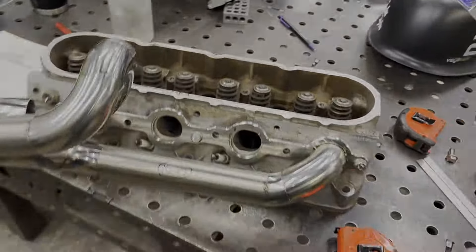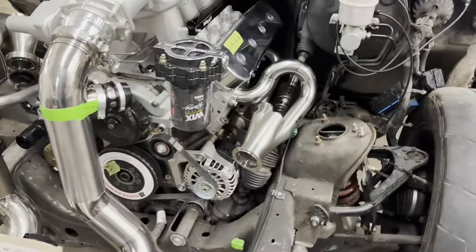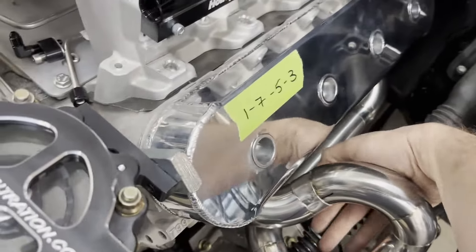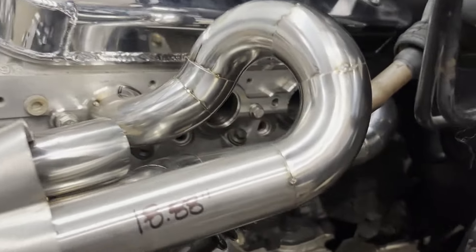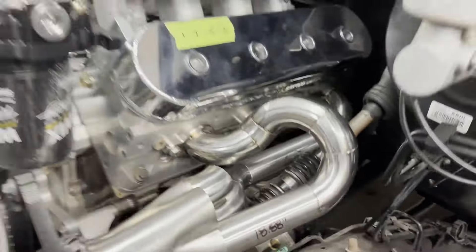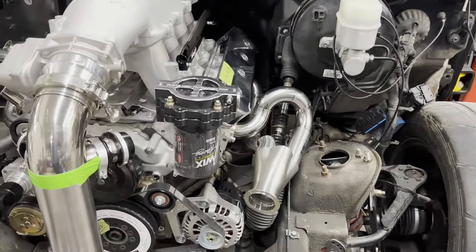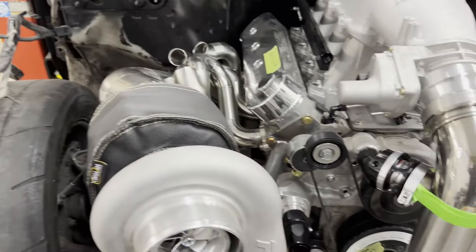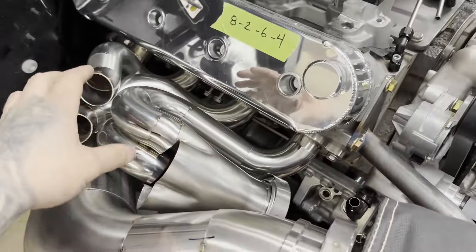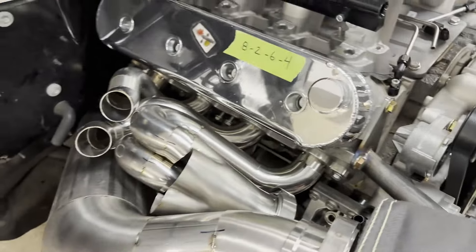Header's on the truck — looks a little crooked but we've got lots of room around the steering shaft, lots of room up top as well, and I have a straight shot at all the plug holes. Looks pretty badass in there so far. I've noticed I'm almost exactly three inches longer on that side than this side, so I'm going to add three inches to these runners and just push the collector straight down three inches — I've got lots of room to do that.